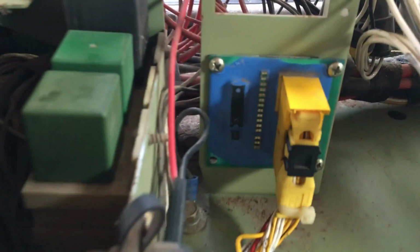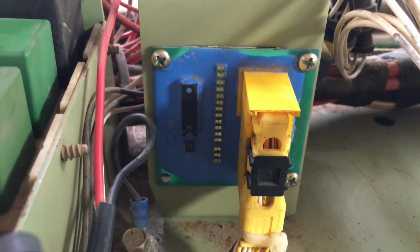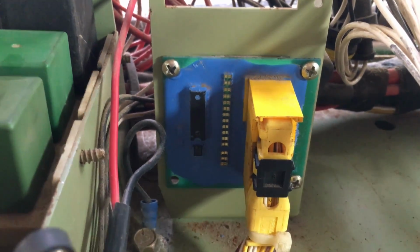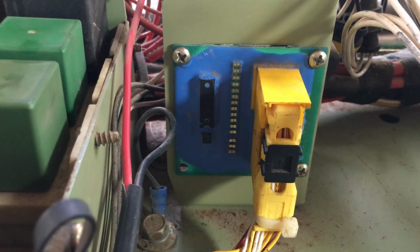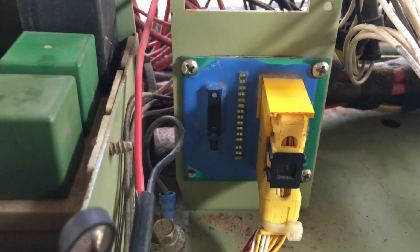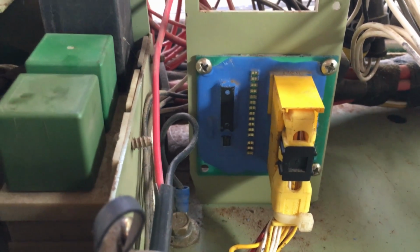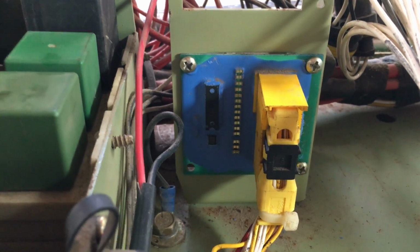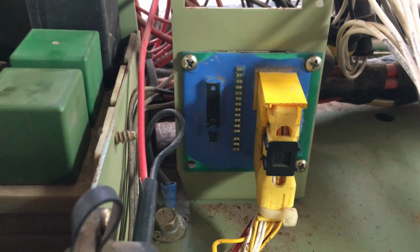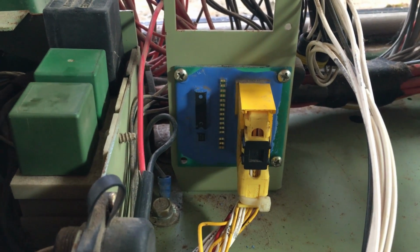this little circuit board here, which looks like it's got a load of, not surface mount LEDs, but on the diagram it says fuse 1 to 15, so it just seems a bit unusual if you've got surface mount fuses on a circuit board. It just seems a bit strange, and it doesn't seem very practical from a servicing point of view. I mean, if a fuse blows on it, are you supposed to just bin the circuit board and buy a new one? And I bet from some of the other things that he's had to buy for this tractor, I bet one of those isn't cheap.